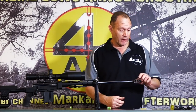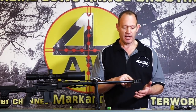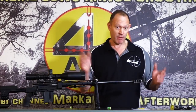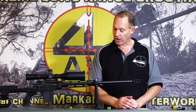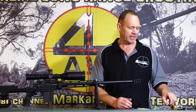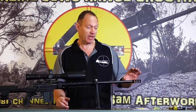Keep in mind when you're rotating this — our brake at least is identical top and bottom, so you're only looking for half a rotation generally. That's what we're talking about when people ask how to time their muzzle brake — making it straight. Shim kits work really well, getting it to a trained professional gunsmith works really well, but if you are on a budget or a long way away, nothing more than a file will do it — and a soft hammer. If you don't have those tools, go and get them — they're not expensive. If you're a gun guy and you don't have basic metalworking or basic shop tools, go and get some. Anyway, that's our timed muzzle brake — it had a shim in it, doesn't anymore, that's on and done. I hope that was some help — catch you next time.